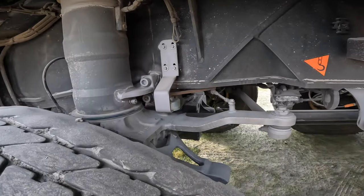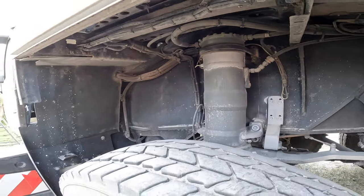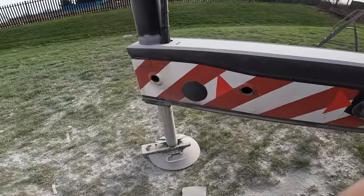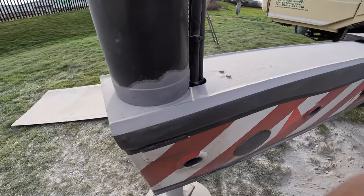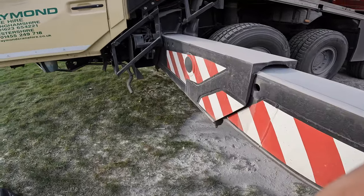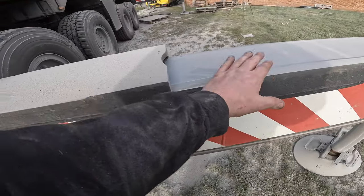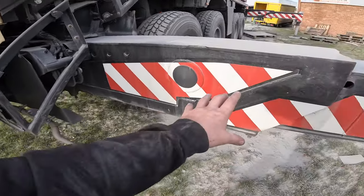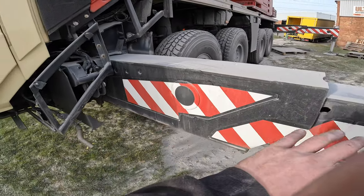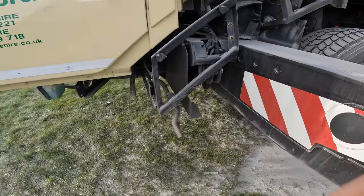Like I say, it's just to take some weight off it for them, because they were just needle gunning round all this lot and hitting it with a grinder and whatever. It'll just take them forever. I just found the rusty bits and then hit them. Like I said, I don't like doing it like that. That was a pretty bad one, and that top was bad, so I just did the top. He says leave the faces because they want to know where the painting goes to. They want to try and scotch them off and paint them, and they'll still see lines. So they're just going to put them back where they were.